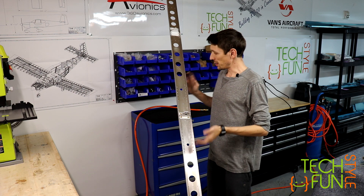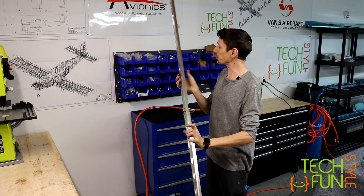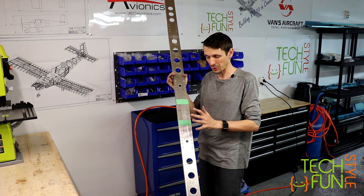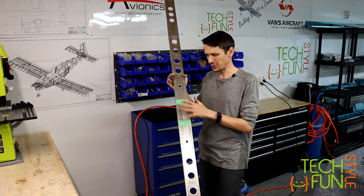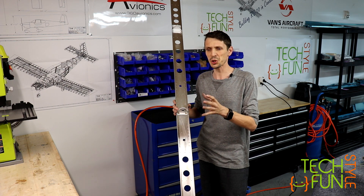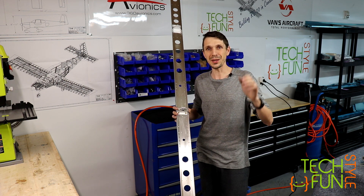That's it for today. As you can see, the spar is taking shape and starting to look like an airplane part. I added the hinges, prepared the parts, and riveted the structural parts to it as per instructions. It took me a whole day, but there are lots of steps and each one has to be done well and properly — no rush here. The two green tapes are protecting holes that shouldn't be riveted yet per instructions — I'll remove them later. My plan for the next steps is to continue with the horizontal stabilizer, doing some aluminum cutting on the machine and making shapes for the angle parts. You'll see everything in my next video. Have a nice day, stay tuned, subscribe, send me your questions, and I'll be happy to answer. Take care and bye until next video.